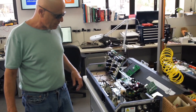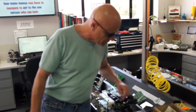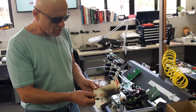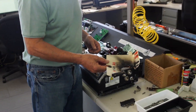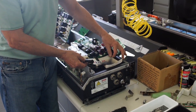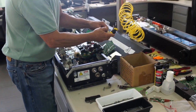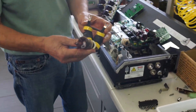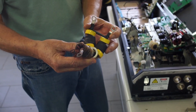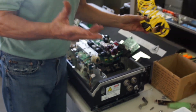In this particular case, this PEM caught on fire inside the DC high voltage section — you can see there was some real carnage here. This is a normal lid that sits on top of this section; these are the high voltage, high current DC connecting cables, and there was some serious overheating — a thermal event, as we call it in the critical power world.